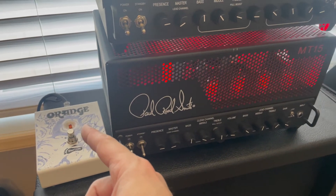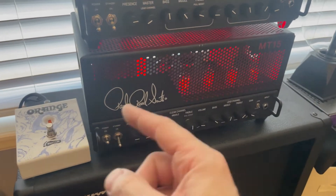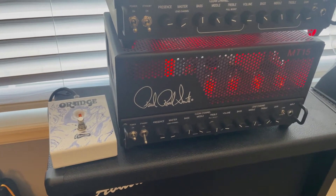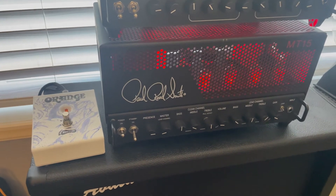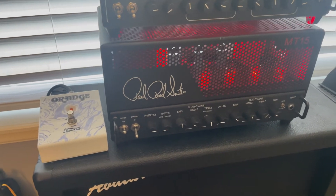Ideally I would rather be lighting up the red channel — have a red LED light up on the red channel, that's typical, that's how we typically see the channel switch work. But I at least want an LED in the foot switch so that I don't have to turn around and look at the amp to see which channel I'm on when I'm starting the next song — that's no good. So we're going to check voltage across this. Again, it has to be on the blue channel.